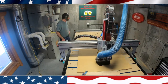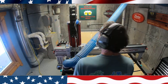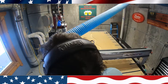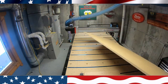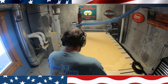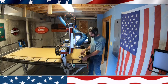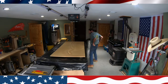This material is three foot by seven foot and it's three quarter inch MDF. Once I get the river slot done, I change the bit and put in the keyhole slot bit, then flip this material over and cut the two keyhole slots I'm going to use to hang this artwork. The keyhole slots are pretty strong. I was worried because it's so big, but I checked and it seems pretty strong.